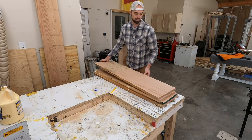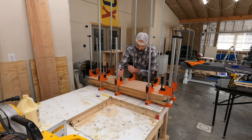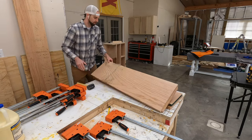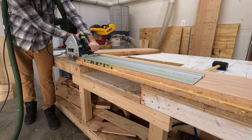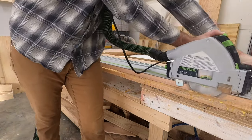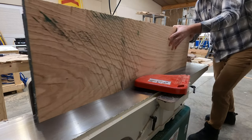Despite taking a little bit more time than it would if you just had thicker stock to begin with, this process does work fairly well. As long as you clamp them together tightly to hide that inseam, you really can't even tell that these are two boards. I left the clamps on for a couple hours and just like that my thinner boards were turned into much thicker boards — the exact opposite of what you normally do in woodworking. And if you would prefer to never see me do this again, feel free to send all the eight-quarter or thicker oak you can find right to my doorstep.